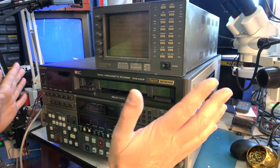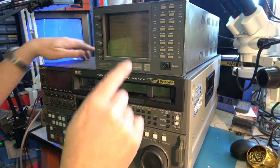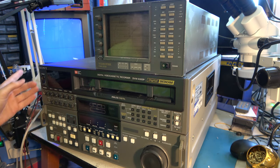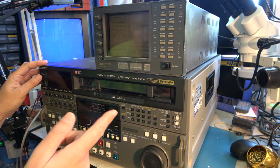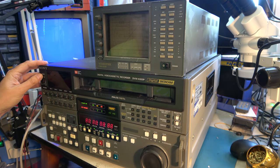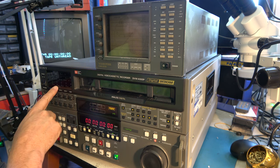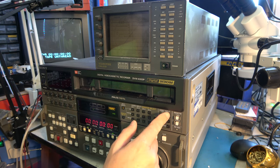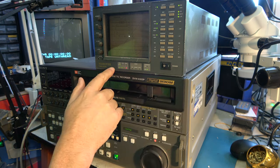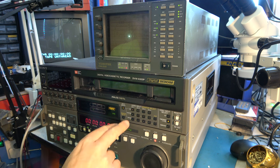What we have set up here is a digital Betacam recorder with no input signal at the moment. SDI out is connected to SDI in on the vectorscope. Composite out is connected to that monitor. If we switch this on — there's a certain key sequence, refer to my old video on when I restored this machine — I think I have to press an audio input channel to get sound, and a video input to get color bars. I think it's saying channel A has a valid signal, but it's just a dot in the middle because it's black.